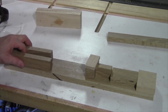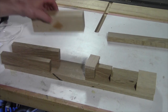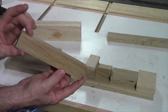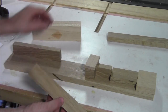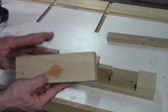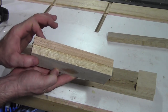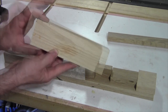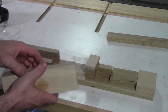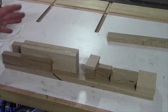On the back end we have two guides — you need two of these. They fit on both sides of the base and the rear slides in the middle. These guides are 3/4 inch thick, 1 and 3/8 inches tall, and 7 and 1/4 inches long. The tail piece — the one we glued up at the beginning — has final dimensions of 1 and 1/2 inches thick with the two 3/4-inch pieces glued up, 2 inches tall, and 7 and 7/16 inches in length. That's the final dimensions once cut down, and it fits in between your guides.